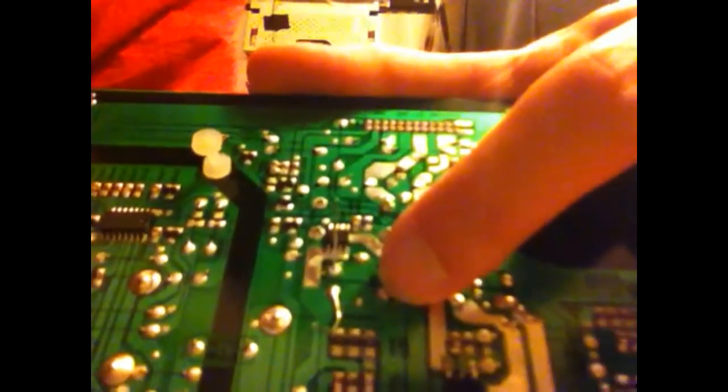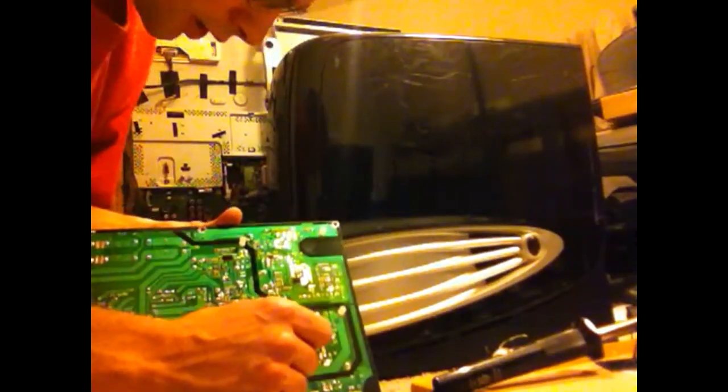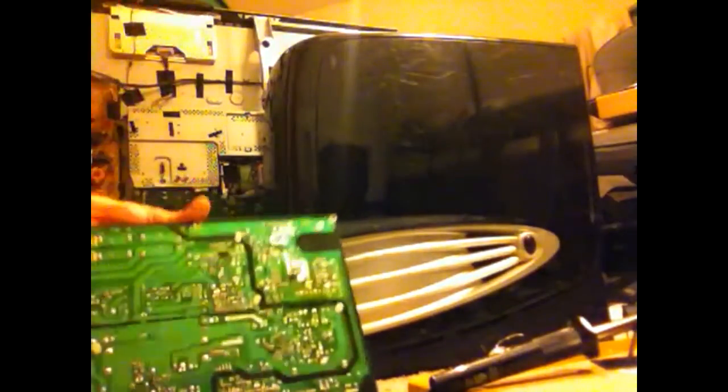Now some of these you will not be able to just use the same iron, unless you want to try a trick, and that is simple. You get connection points where all you have is a solder blob and a hole. Well, then you have to stick the lead into that, heat that little hole up, and you're pressing the capacitor through. And then all you have to do is resolder that. And on this one here, I have both holes I've got to redo. Otherwise, you can go to Radio Shack, and they sell desoldering irons, and they have a desoldering pump, which you have to use two hands. The desoldering iron, you use one hand. I have videos about that on my channel you can look at.